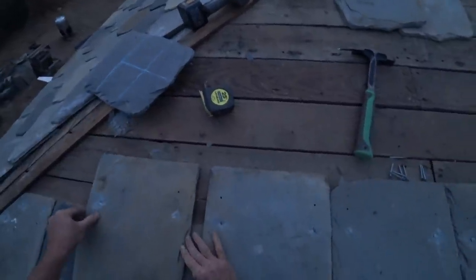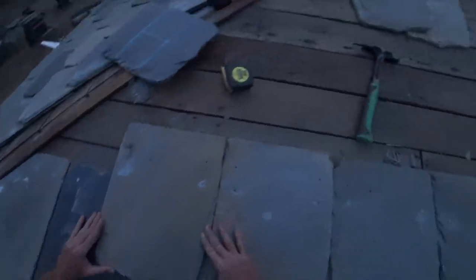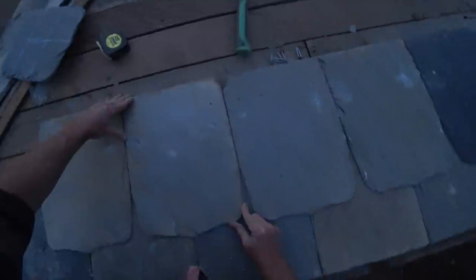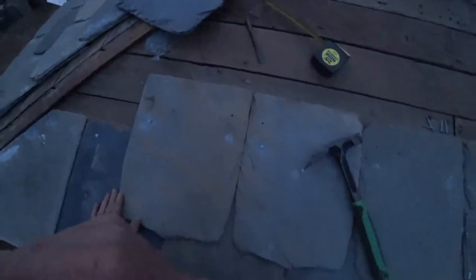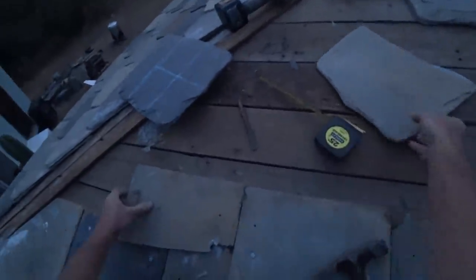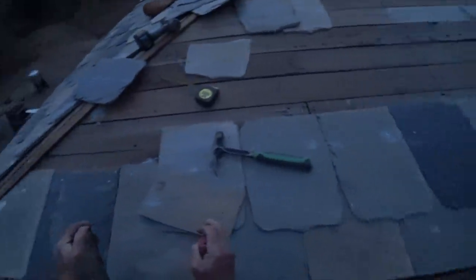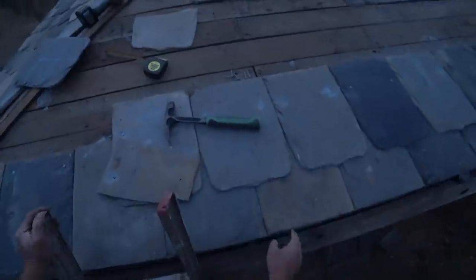If you look at the holes that are just above these slates by like a half inch or so - they don't have to be that close, but roughly that's what we're shooting for, just above the previous row. This slate is cracked - I thought I tested this. I probably cracked it with the hammer. There goes a slate - it happens. I did notice I nailed this a little bit tight, so I probably just hit it too hard. That may come in handy for doing the far corner.